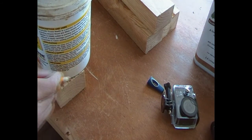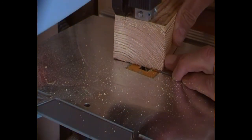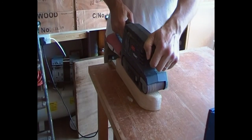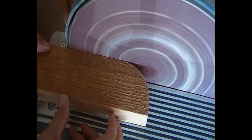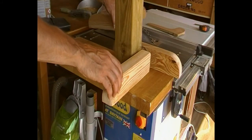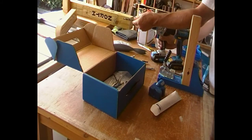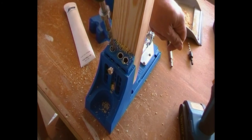I didn't want it all fixed, so if part of it did rot or suffer in the weather it could be replaced. I used the bottom of a jar to create the curve, cut that on the bandsaw, and then sanded everything off. These are just pieces of old, tight, well-grown, close-grained pine — I made four of them which would run around, and the post would slot down in the middle. I had the idea of using pocket screws, putting them all on the inside so there wouldn't be any exposed screws on the outside, which would seal better against the weather and also look better aesthetically.